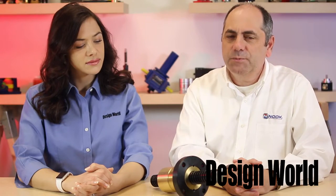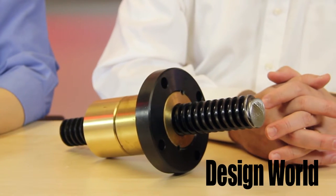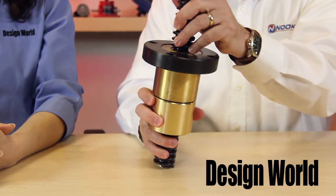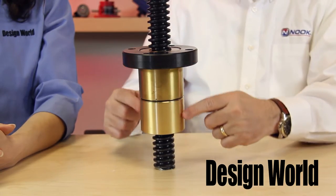Sure. One of the concerns when designing a lift platform using a screw jack is how to know if the travel nut is worn out or about to fail, especially when someone might get hurt. What we have here is a follower nut assembly, or typically called a wear indicator nut. How they work is very simple. When mounted vertically, with the load always in a downward direction, the device takes advantage of Newton's law of gravity.